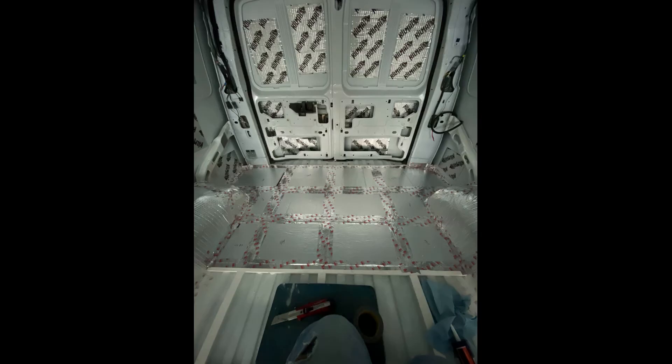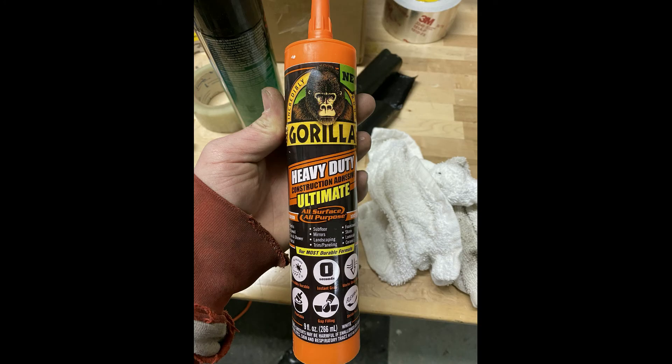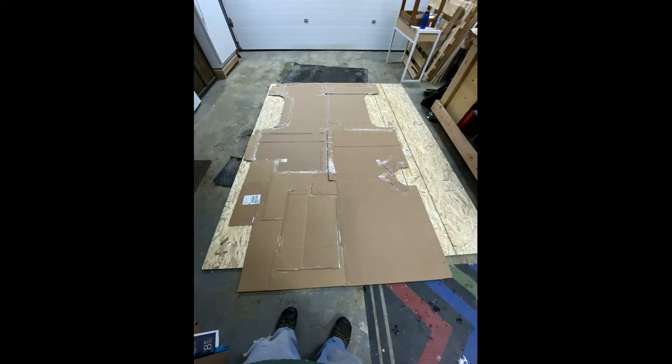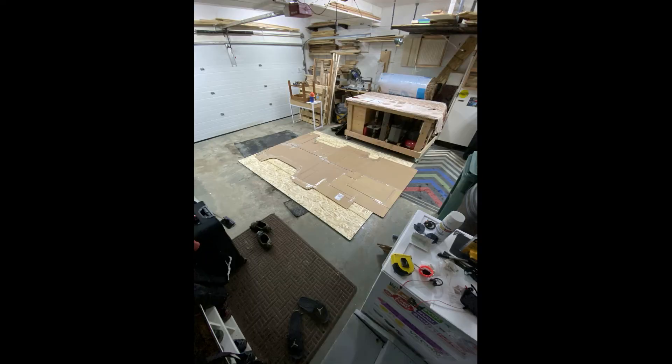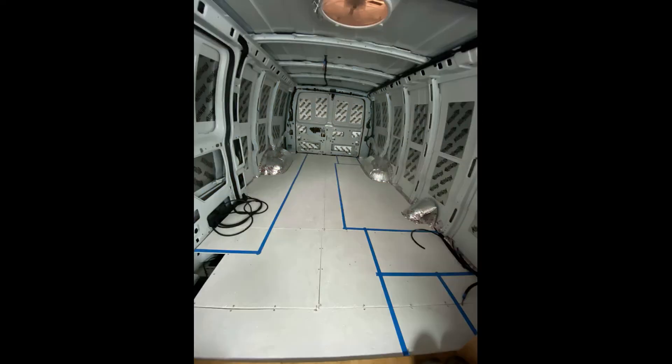This is a drawing of every square of insulation in the van — floors and walls. I used half inch poly iso for the floor and foil taped every seam so any moisture would get trapped in a bathtub effect. Every piece was glued in with Gorilla Glue. I went to our recycling center, grabbed cardboard from the bins, and made a giant template of the floor to cut out my plywood. I test fitted the floor, then took it back to the garage and painted all sides with mold resistant primer.